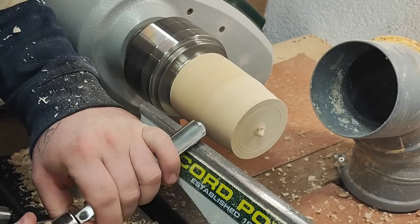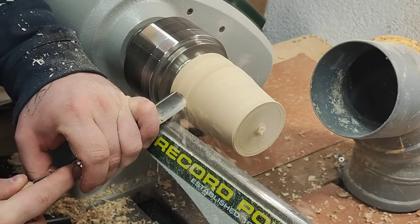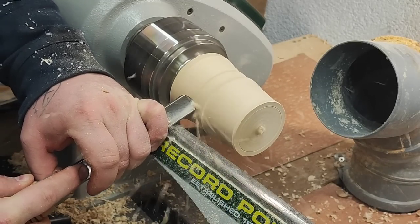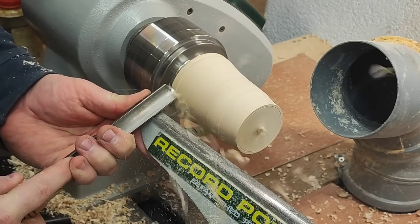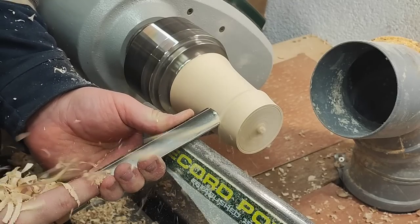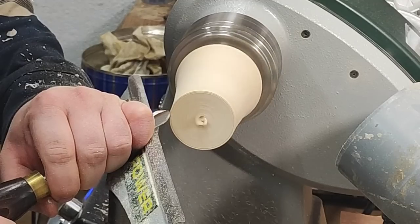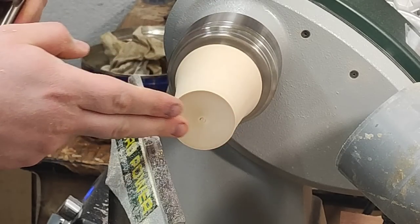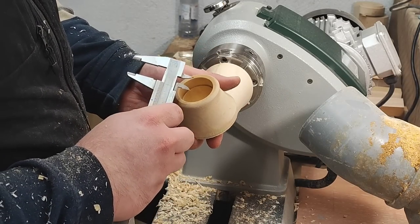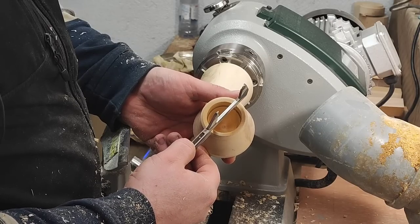The rest is too high. I'm going to rough the top and make the inside inward tapered. Now as I'm close to diameter I'm going to measure the widest part of the connection.